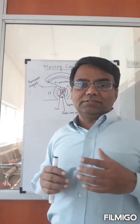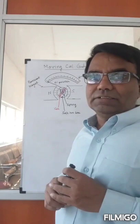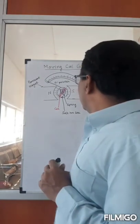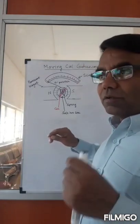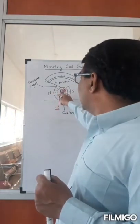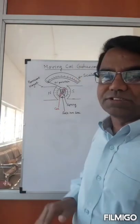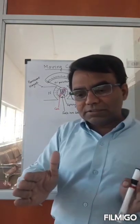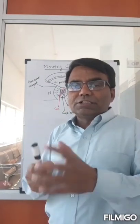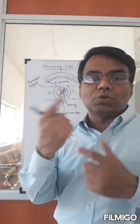You don't need that oscillation. What you need is to know how much it deflects. That can be found by using a spiral spring connected to the soft iron core and then to the body of the meter, so when the coil tries to turn, the spring will pull it back. It's a torsional spring — not a linear spring — it's more like a mosquito coil.